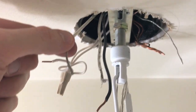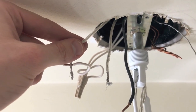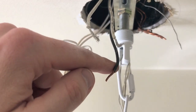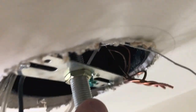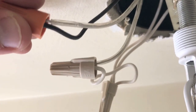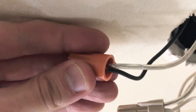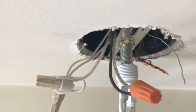Now it's back to the actual electrical wiring. We have two wires that feed out of the actual bolt from the chandelier: one will go to the neutral and tighten down with a cap; the second will go to the hot wire or power lead and tighten down with a cap. The third one — our ground — will loop around that little green screw. I've got the neutral wires connected and screwed on with the cap. For the power lead I'm using an orange cap — insert both the power lead and the additional wire from the chandelier and twist clockwise so those wires twist together.